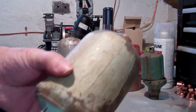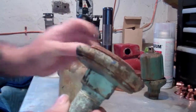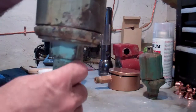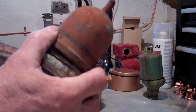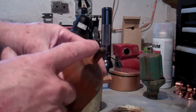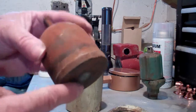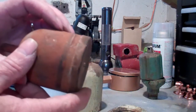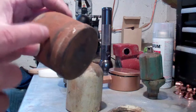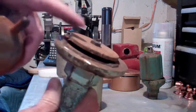It's so big it barely fits in the screen. Inside the base, that's all there is for the air vent. It's similar to the Hoffman 75 — it uses a thermostatic capsule with a built-in peg, so there's no ball at the top, just a post built in. It has a concave bottom that will dimple out, like a pickle jar lid when you open it, once the steam vaporizes the volatile liquid inside.